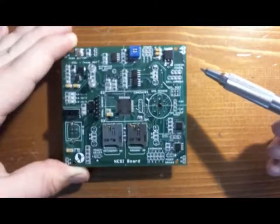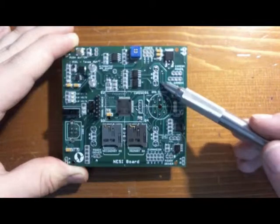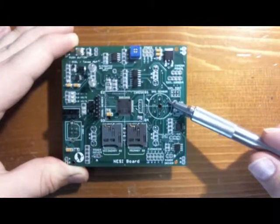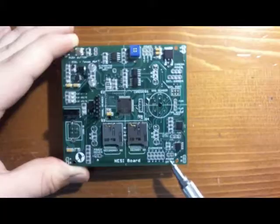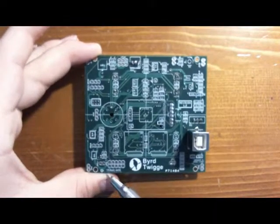The NESI board has 5 main power drivers, 2 of which control the blue LED bank and the red LED bank, one that controls the gas sensor's heating element, and then 2 other multi-purpose ones. These multi-purpose ones can be accessed at power driver A and power driver B, which on the back are labeled JP2 and JP11 respectively.